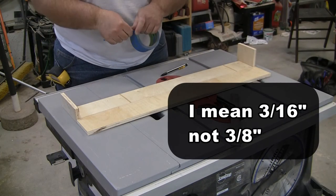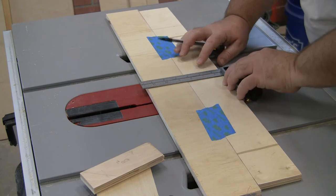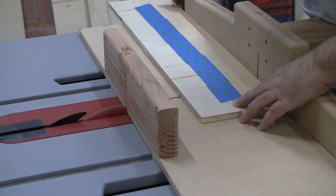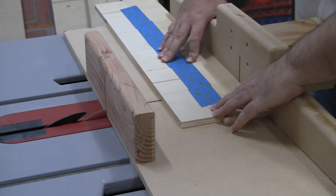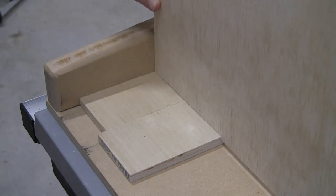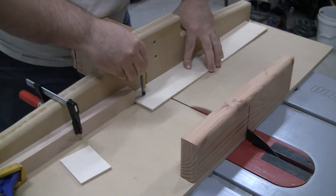I'm going to use 3/16 inch plywood for the dividers in the bottom scoring slots. To make sure that the dados line up, I tape the bottom piece and the bottom front piece together and mark where the dados will be cut. Using my table saw sled, I cut the dado by raising my blade about 1/8 inch and making two passes, then moving the boards over about 1/16 inch and sneaking up on it until I get a good fit. I repeat for all slots. It's okay if your dado is just a bit off — no one is going to notice. I then rip my 3/16 inch plywood and using my sled and a stop block, cut 5 dividers.